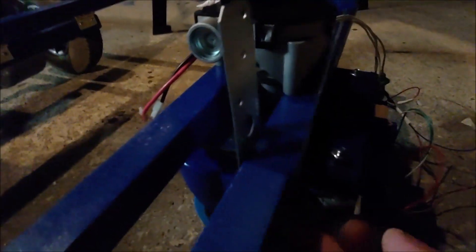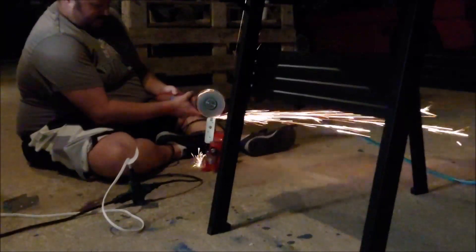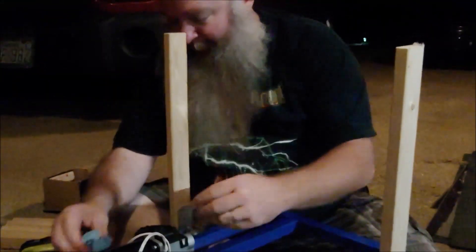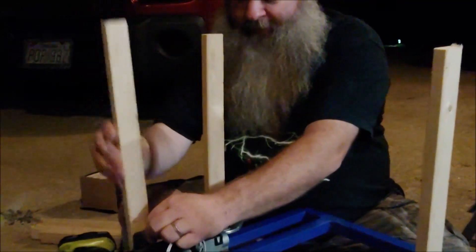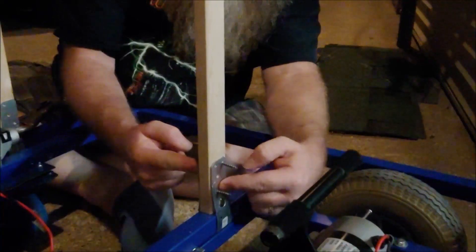Then we cover the bench with carpet to make it more comfortable than just bare wood. So now we've got all our brackets made. I've made some marks and Scott is grinding away bits of metal so that it can fit up around this front piece. He's ground these pieces for me and what I'm doing is clamping one of the uprights. I've already marked the frame in several spots for the bench width. We're taking these bits of metal and pinching them up through around the frame and then screwing in from both sides to lock it in place.